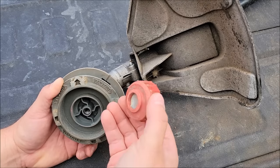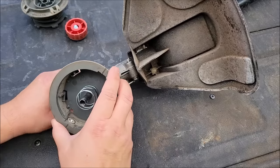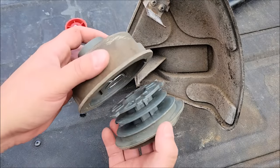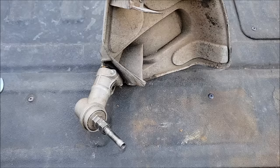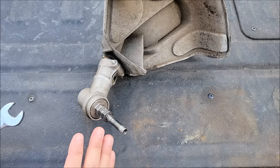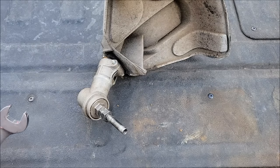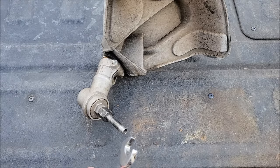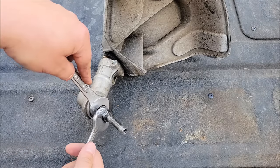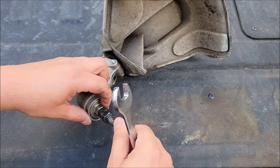Alright, so here's that bolt - it's off. All that's really in here is this spool mechanism, and then you have the casing for the head. So now basically you've got this whole head taken off. The next thing I need to do is take this shaft bolt off. It shouldn't be on there very tight - mine wasn't. This is a five-eighths wrench. You put a five-eighths here and here, and again you're turning backwards, not your normal way. Loosen it up and twist it all the way off.